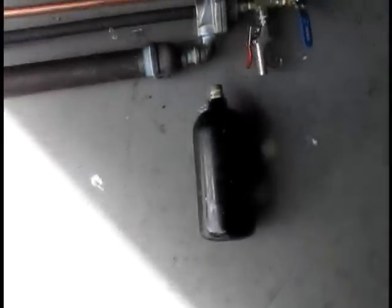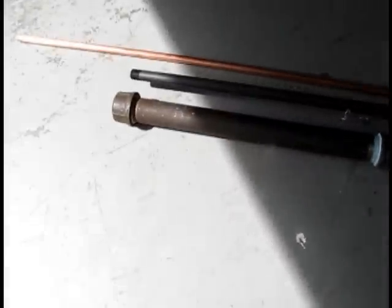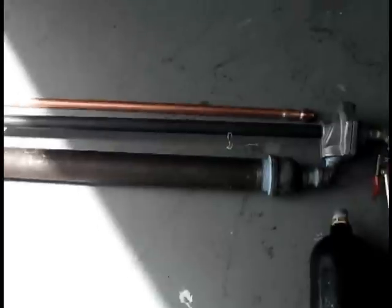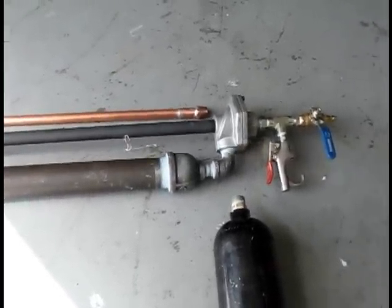We've got two reservoirs now: a 48 cubic inch paintball tank which is good for doing higher volume stuff, so heavier objects. And then a 32 cubic inch steel plumbing reservoir - it's got a bigger orifice on it so it launches air faster, it's better for launching AA batteries, BBs, stuff like that.